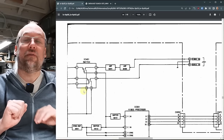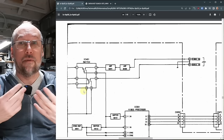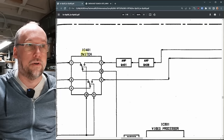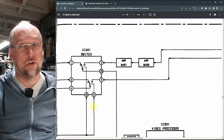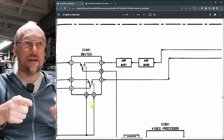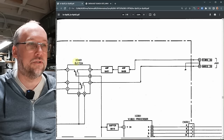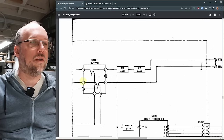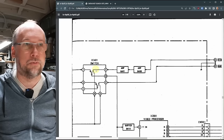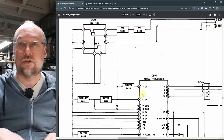Very typical for Sony TVs, switching between different video inputs — the tuner, external inputs, or multiple video inputs on higher-end sets — is facilitated by a separate switch IC (IC401), also under microcontroller control. When you hit that TV/video button on the remote, the microcontroller tells the switch IC to switch between inputs. On this simple set, there's a video-in and audio-in going into the switch IC, and the other inputs from the tuner. The output goes directly into the YC inputs on the video processor, which gets turned to RGB.